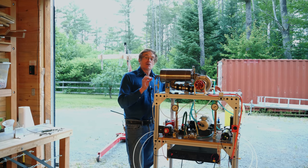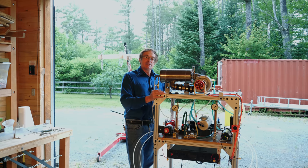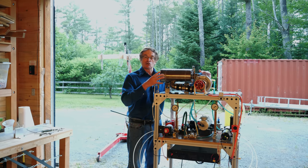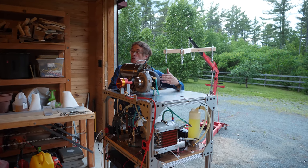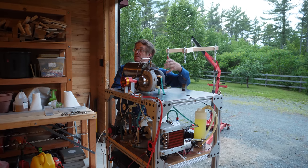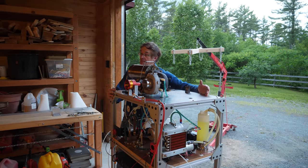If you remember the very large turbocharger I had on the table when I was discussing the afterburner, that turbocharger is going to allow us to build a compound turbocharged jet engine — essentially two-stage compression. And that turbocharger will fit on this larger stand, as will the turboshaft project we'll get into later this year, where we turn the hot gases into mechanical output. Build it big, and then you don't have to build it again.